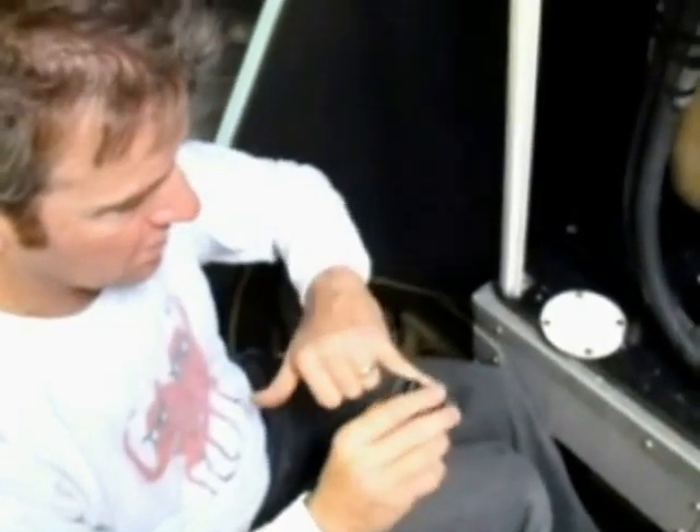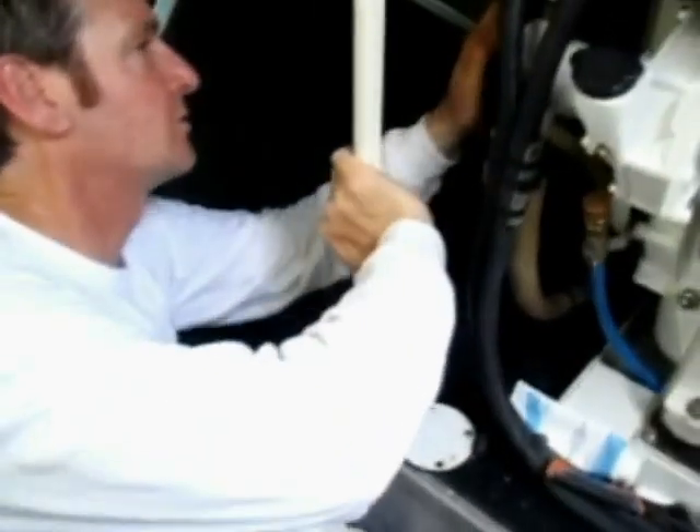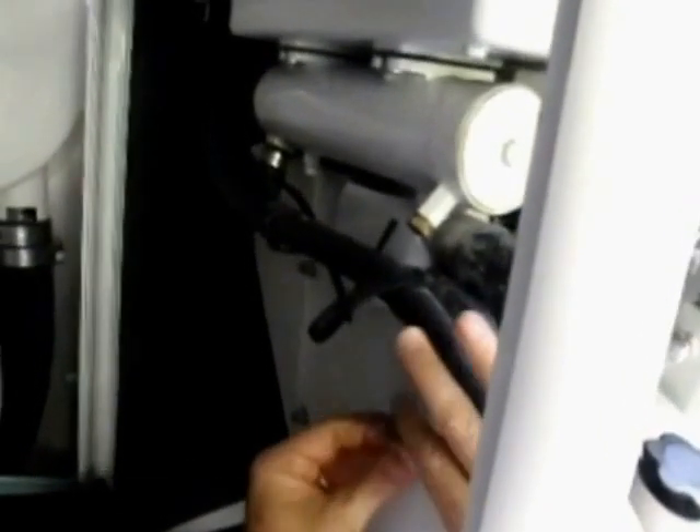Now I'm putting a little bit of grease on the shaft so that next time when we take this apart it's easier. Did you see how I was able to just pull that impeller out? Sometimes it's just stuck and instead of doing what we're doing right now, you're off doing some really difficult pull. See how I'm just sliding that right in there? Just push it in with my hand, take this little piece, push it over the top, and that hopefully seals off that shaft a little bit. Now I take my cover — I can see my old mark where that mark was sitting against the little compressor.